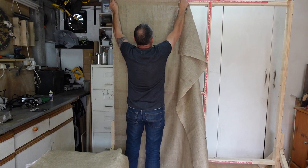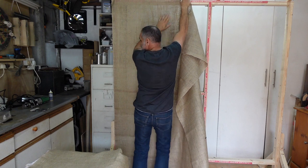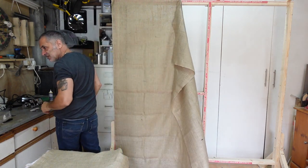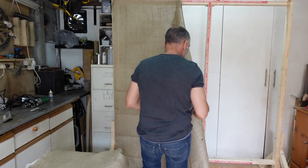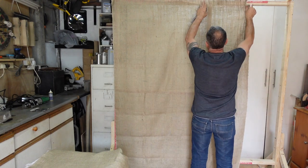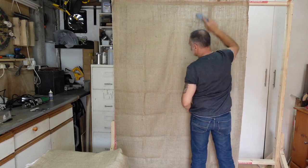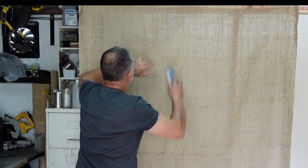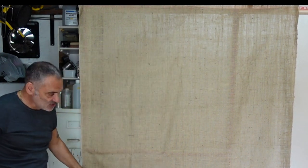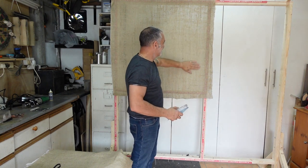So I begin with hooking up this Hessian, starting from the top. Watch your fingers on these nails on the carpet tack strip because it's quite painful. In fact, I've been using one of these, which is just a scrubbing brush — great for pressing down the Hessian without having to get my fingers caught on it. I've got it all tacked in at the top and now I can see where I want to cut it, so I'll just cut that for now, which will make it easier to stretch. You can see that is quite tight now.